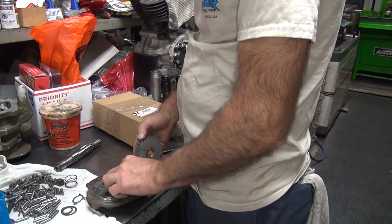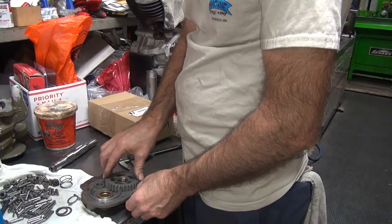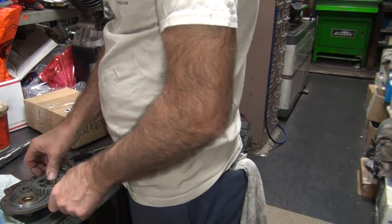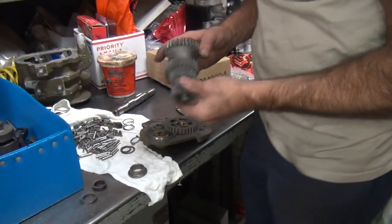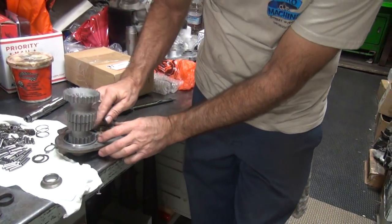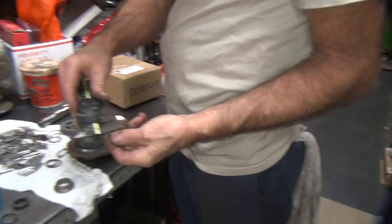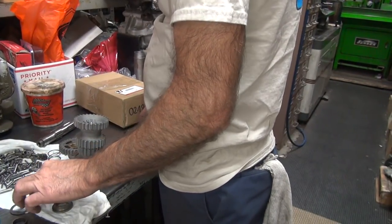See, ideally I want to have a washer here between these. See, like that's up in the air now? Seems to help it. Yeah, it gets me off of that edge. Right. And it makes it line up with this other side here. Still way lower, so the washer needs to be thicker than this one. This is a pretty thin washer. Yeah, it's 40. So if I had a 60 thou washer, that'd be about right.